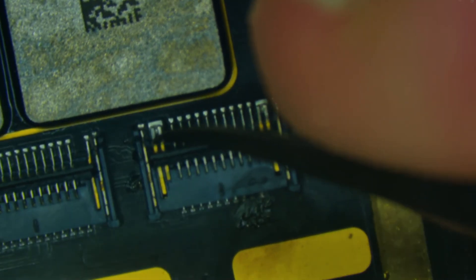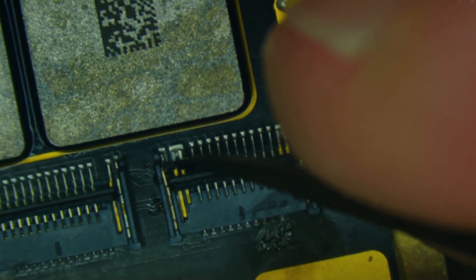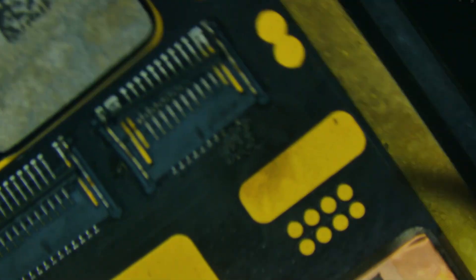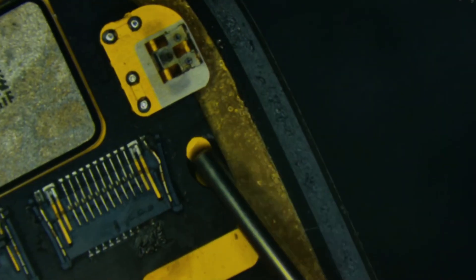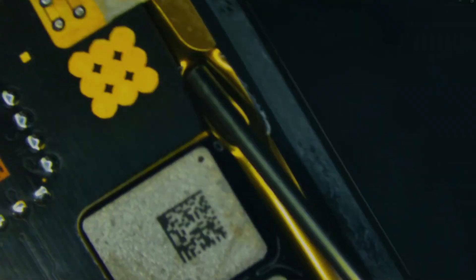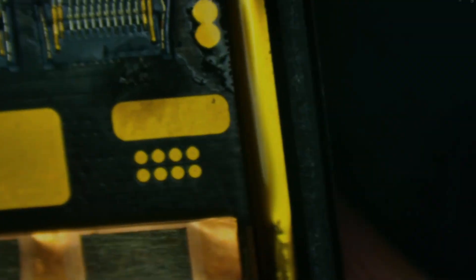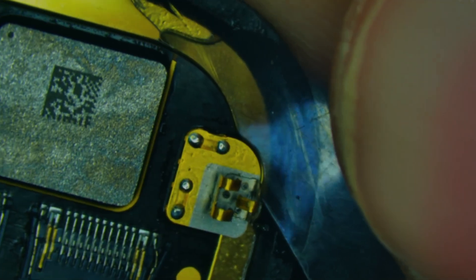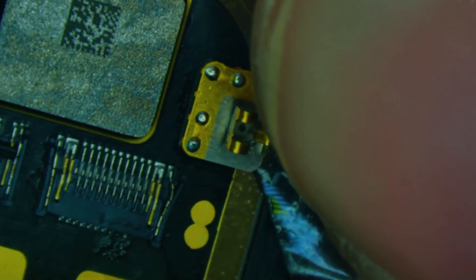Tried to work on it, see if I can touch up the pad, but there's no luck there. So the first thing I'm going to do is salvage this flap — they tend to break, so it's always nice to have some on hand. I'm going to gently push out the arms so I can push out the connector. In order to not damage the display, we need to remove this PCB from the back of it. I'm going to add some isopropyl alcohol around the perimeter — this will help as I go to remove it.